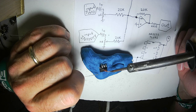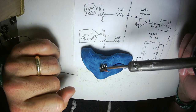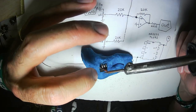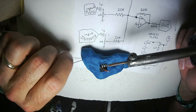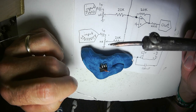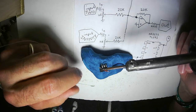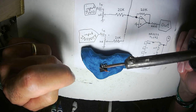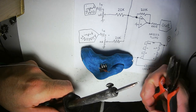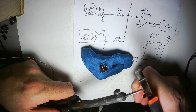Copper is a really interesting metal because it anneals pretty quickly and easily. After a soldering iron tip that's made of copper has been in use for a while, it gets very soft. That's part of why the acid in the flux, the core solder, will eat it away. When that happens to mine, the cool thing about being annealed and softened is that you can easily squeeze it sharp with, I guess, a handy dandy multi-purpose soldering iron tip tool.